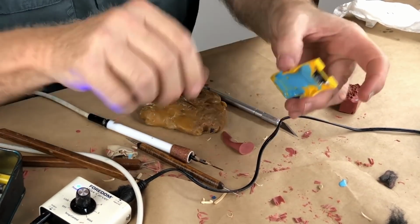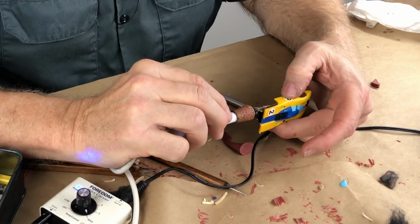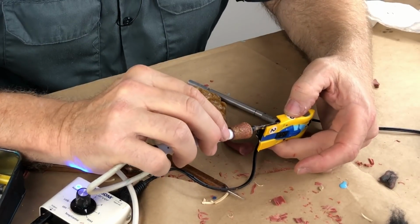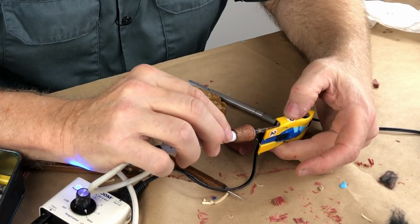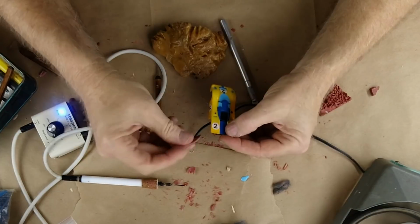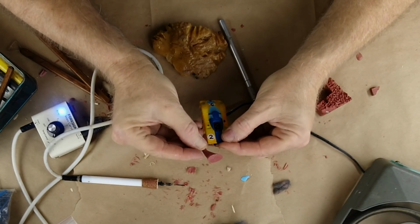We got the rubber on this side all trimmed up nice, and it's looking good. Now, let's put the sprue and the vents on. Get a little sticky wax going on. And what we're going to do is just lay a bead of sticky wax right in this area. And what we want is a shaped sprue. In other words, a sprue that fits perfectly to the object.